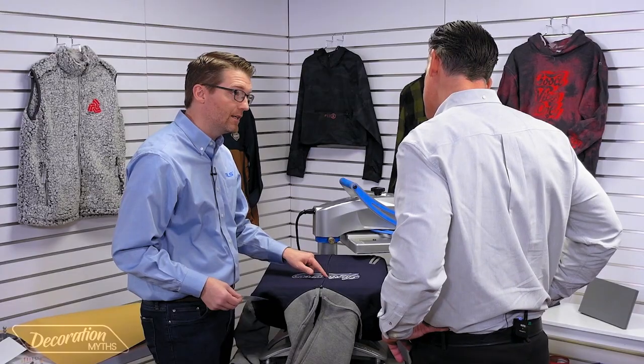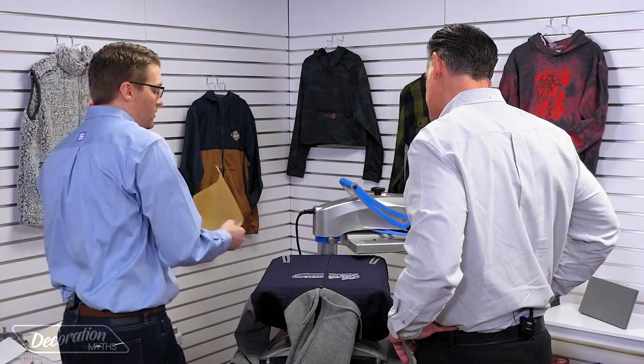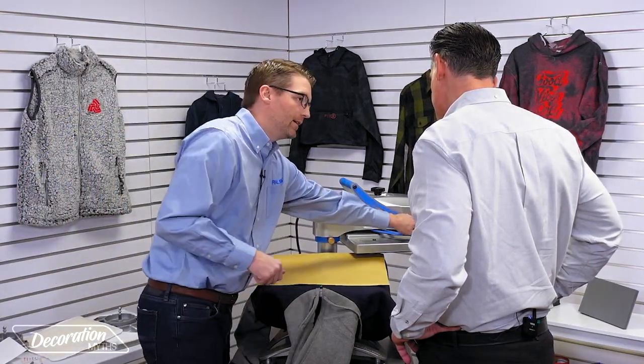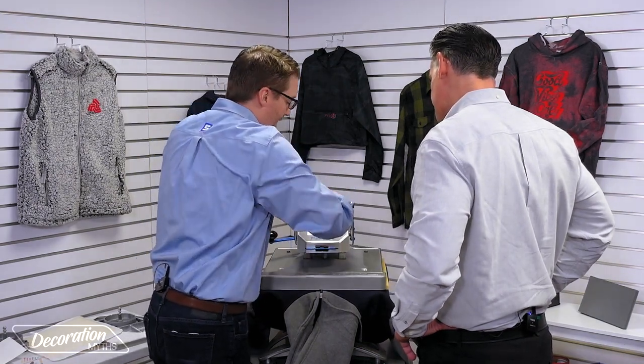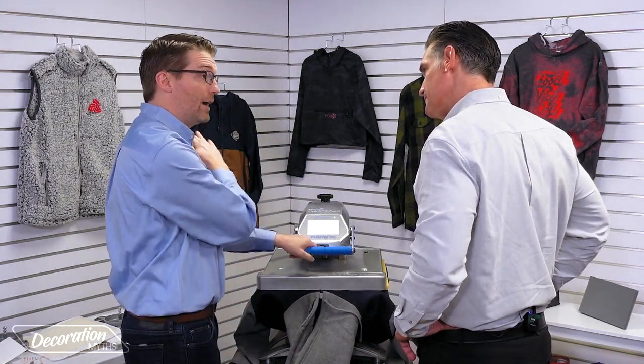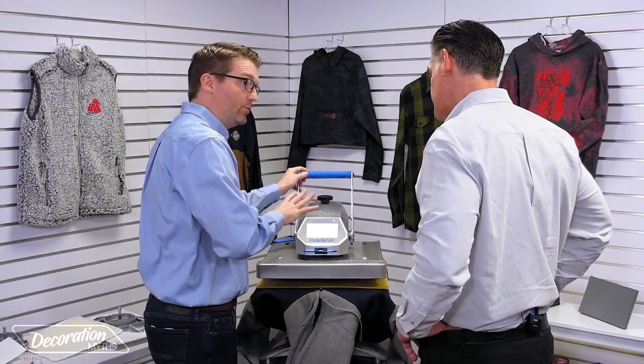What that's telling me is I didn't get adequate pressure close to that zipper. And so again, no harm in that. I just know that maybe you want to hit it with some pressure because I didn't have enough pressure on my application. So I would run it through a full additional 30-second cycle to make sure we have a durable completed result.